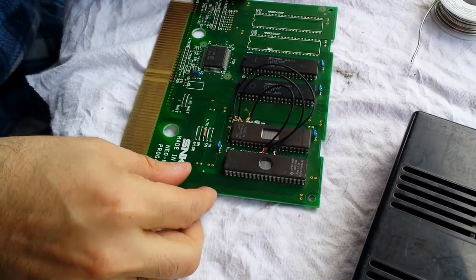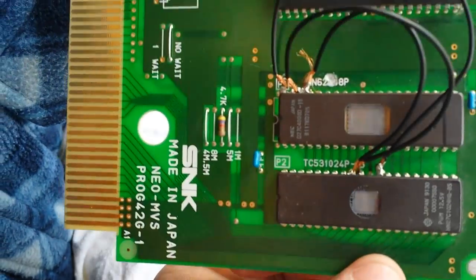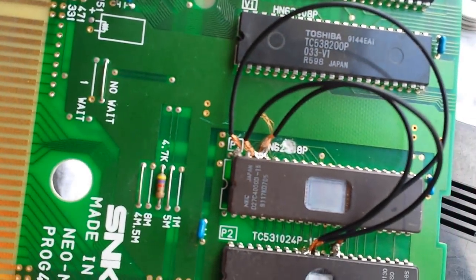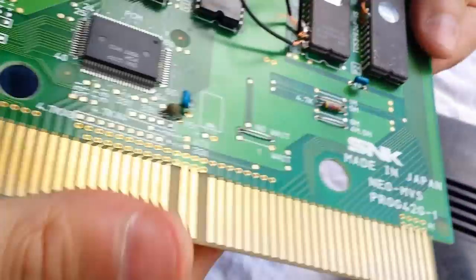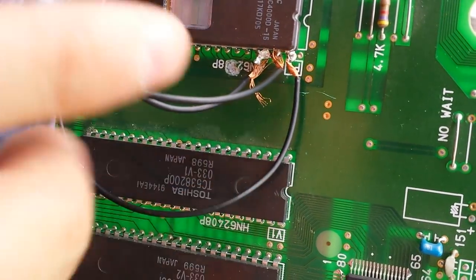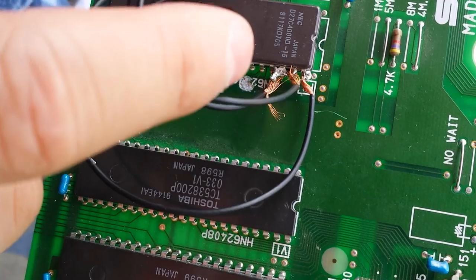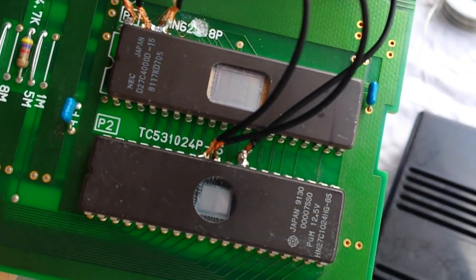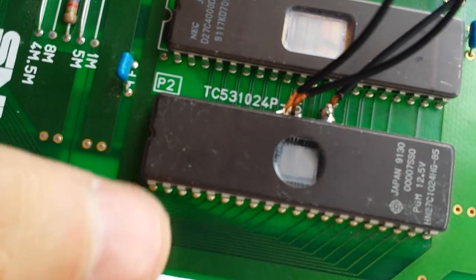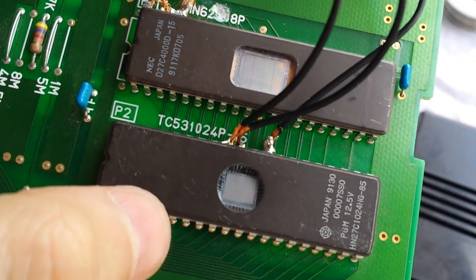Here's the update - it's getting very difficult. At first it started okay, I have to admit. The first one went well. Second one was a little meh, but now the soldering is all coming together and it's all mishmash. It's getting tough as well. Now every time I put a lead in, or a jumper, I try the game and still nothing - it doesn't recognize it. The Neo Geo just passes from slot two to four.